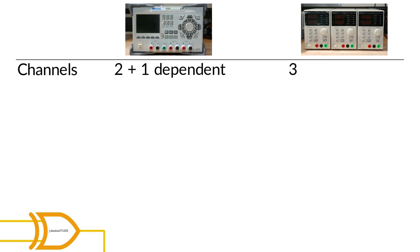Let's come to the technical features. The Rigol is not a full three-channel unit but only has two independent channels — this means that channels two and three share one common ground. While I knew this when I bought the unit, I rarely needed a full three channels. Sure enough, by the time I needed them, I had forgotten about it and was annoyed that I had to change my setup around because the intended way wouldn't work. On the Korads, each channel is entirely separate.